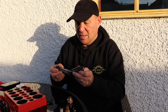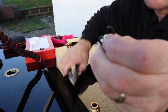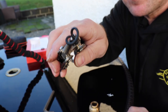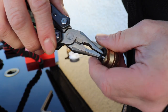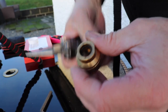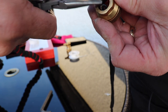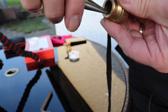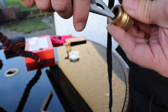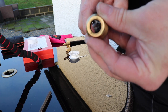To get the O-ring back in it's a bit fiddly. The best way I found is to use a pair of needle nose pliers, put a kink into the O-ring and fold it in on itself. You can then hold it into position with the pliers and feed it inside — there's a little groove in there and the O-ring just fits into it. Push it in so it fits all the way around and seat it back home. Make sure it's seated well all the way around; it's a bit awkward but it will go in.